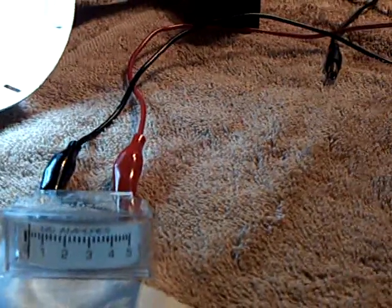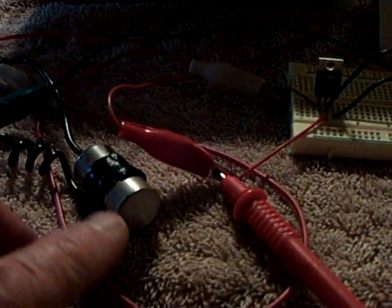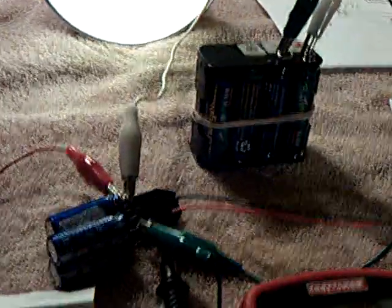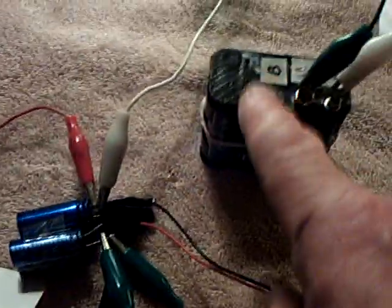It's 230 to 240 milliamps. I've got the bridge rectifier — the earth ground is coming in right there going into the bridge rectifier, and then the plates inside the box here, the blue plate. I've got the little ignition coil capacitor, which I think is about 300 to 400 volt but very low microfarad. It charges up real quick, and then I've got it pulsed with the SCR and the neon, going into the super cap — that's a 5 volt, 20 farad bank of super capacitors. And there's the voltage on this little system, which is this half-dead battery pack and that capacitor pack holding it down.